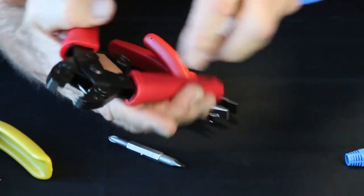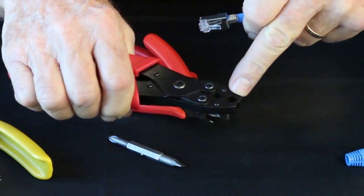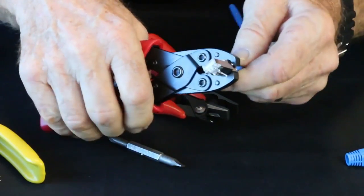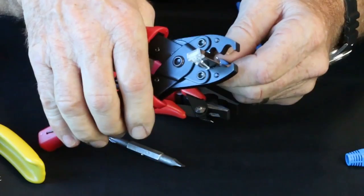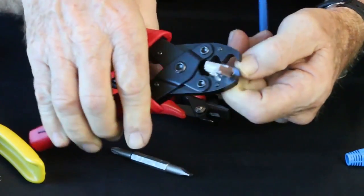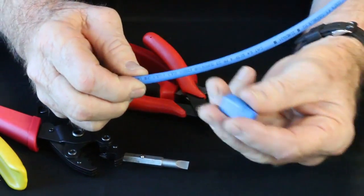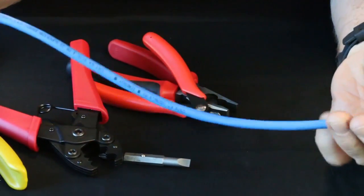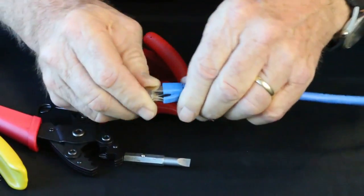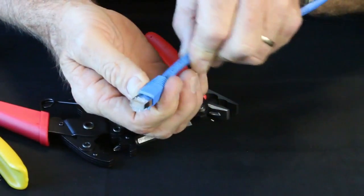And in the kit, you have your crimper, your CT360, and 2 cavity sizes. Start with the big one and then use the small one. So lay it in there and get her set, and we'll pass it to the smaller one. And that's a pretty good crimp. So we're ready to roll. And I should have put this on first, but I'm going to cheat here. We have a short cable, but we have oversized boots for different big cables. Makes a real nice finish. You slide it on, and you got a custom looking, ready to go 10 gig Cat6A termination.